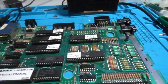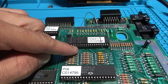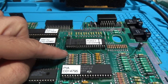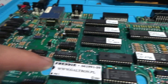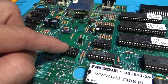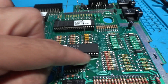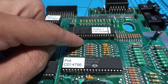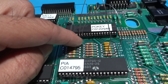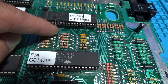I checked the bottom of the board because there are traces on the top — you can see these traces on the top, so some of these pins rely on those top traces. It could be that the traces are okay, but originally the Freddy chip was bad. I may have messed up the other chip, or it was on its way out. Because I put sockets in, I cannot see the top portion of the board, and the solder joints can't make that connection — there's no way. That top portion was not making a direct connection.